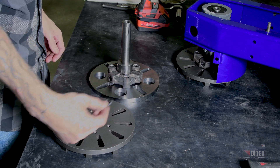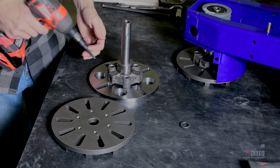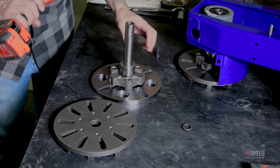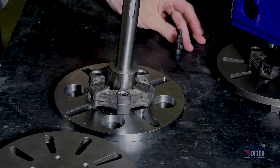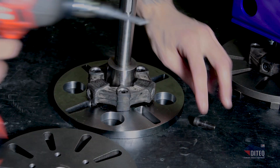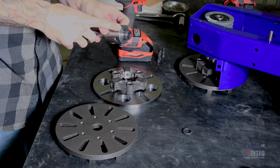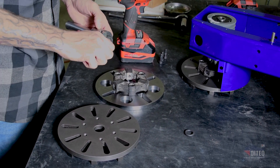You're going to get an o-ring as well with this plate, and we're going to show how to remove that. The first thing I would do is remove the shaft with the three allen bolts — six millimeter — and then your shaft should come out with a little twist. And there's your o-ring.